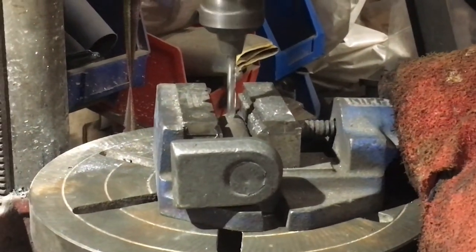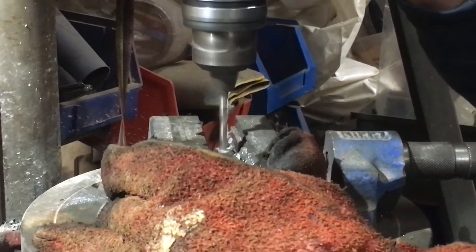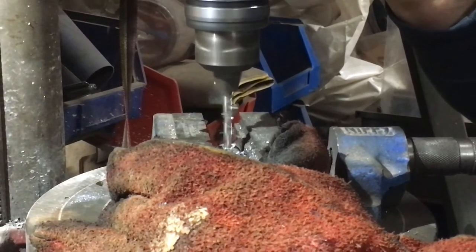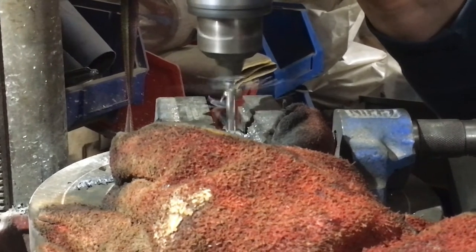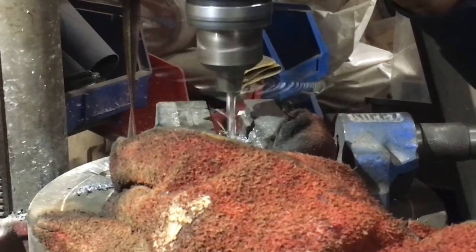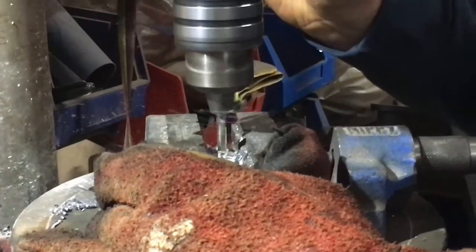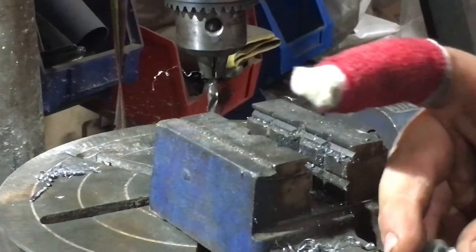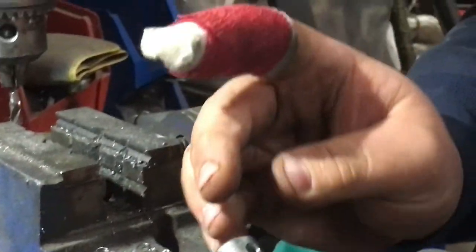The hinges I've got don't have a hole in the top, so I'm just going to drill a hole in the top of each of them so we can put a pin through to stop the pigs lifting the gates, because they can be a bit painful at points. It's a little bit slow progress because it's been forged so it's quite hard. I'll have to run a grinder over it to get the burrs off - it's a bit oversized but when it gets galvanised this hole will get a little bit smaller, so we'll weld this onto a post later on.